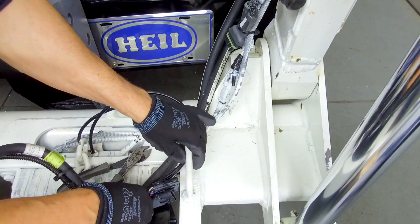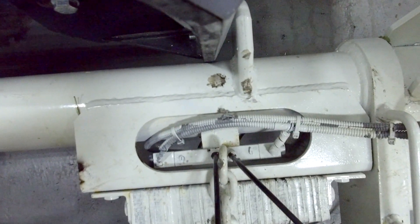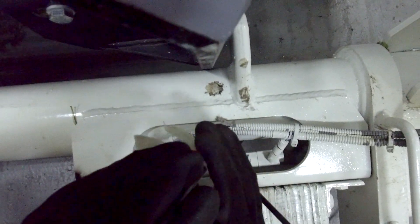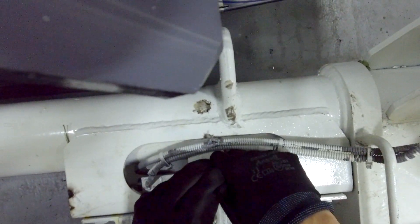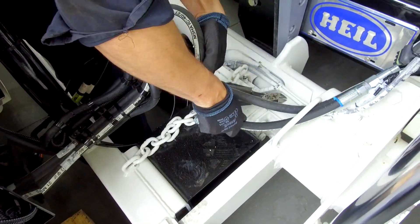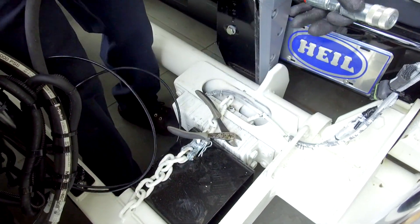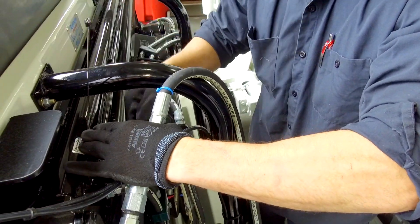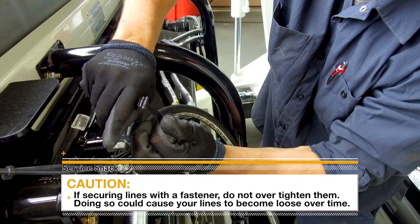Remove any cable ties securing the electrical cables to the truck side. If equipped, disconnect the two CaradoCan auto-cover airlines. When disconnecting the auto-cover airlines, be sure to mark one of the airlines so that you will remember where each line goes when reconnecting them. After properly marking the line, push down on the connector retainer and gently pull the line out. Unroute the electrical cables and hydraulic hoses from underneath the routing guide bar. Then connect the CaradoCan pressure and return lines together to help keep them clean. Secure all electrical cables and hydraulic hoses to the CaradoCan, making sure that these are off the ground.